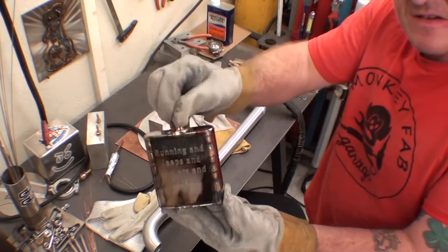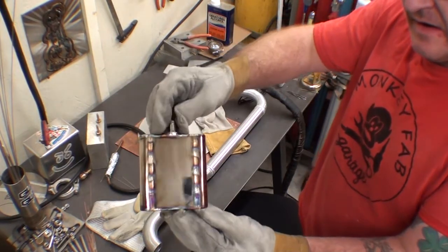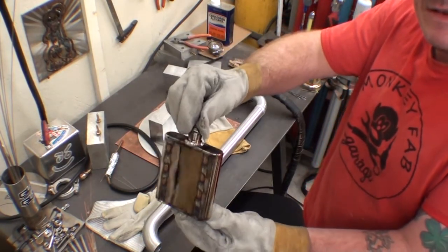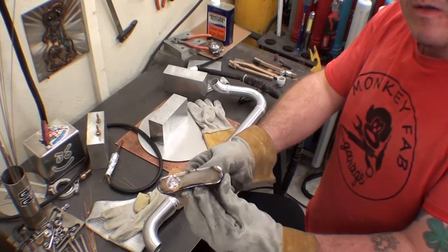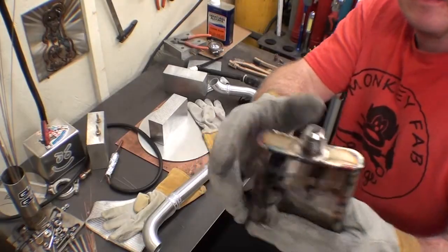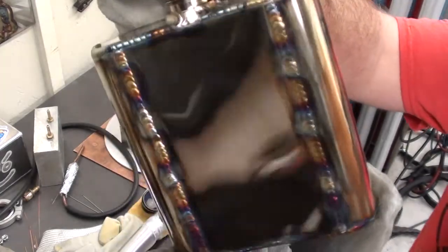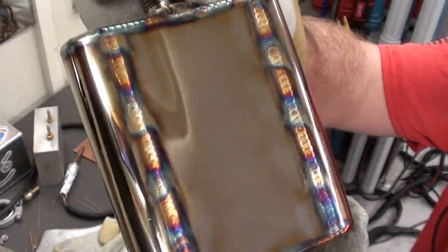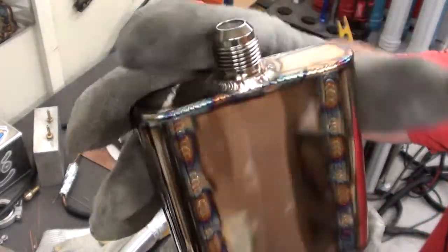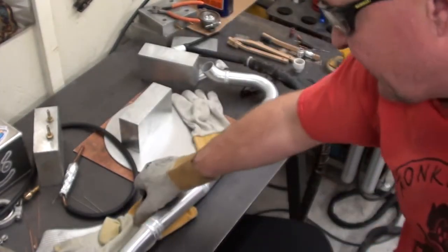You got to see how we went ahead and made that upper radiator hose, how we added the bungs by just stacking some aluminum on there. It's something you can do at home. You'll also notice that I once again used that center drill when I went to pop those holes in there, because if I was just using a regular bit, it would tend to want to walk all over the place. So, you know, a little bit of tap in the center with a center punch, and then follow that with the center drill, and you'll be able to drop those holes exactly where you need them.